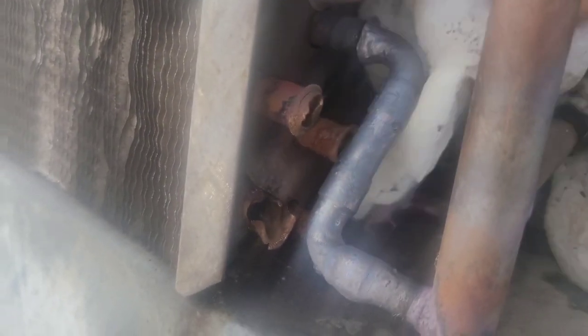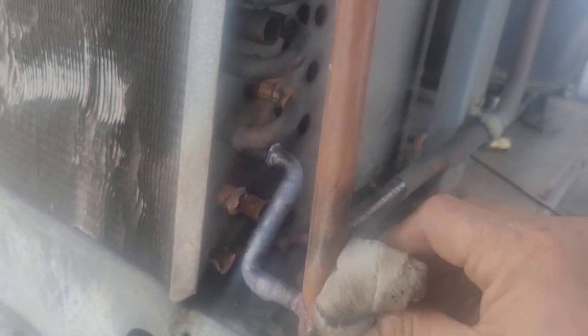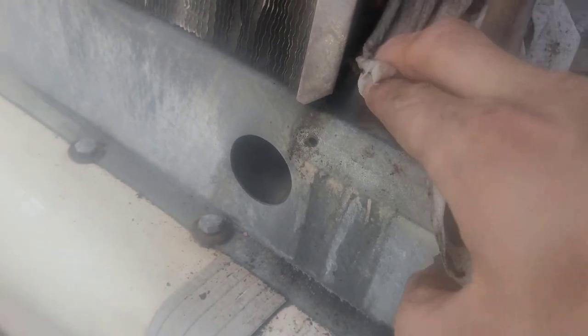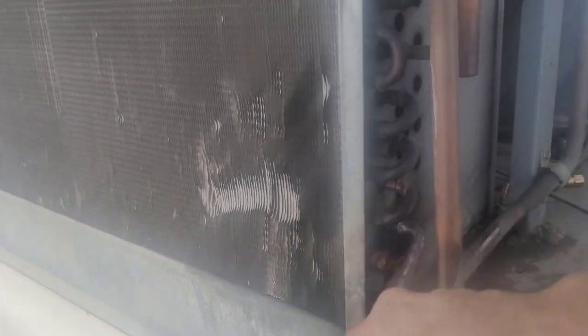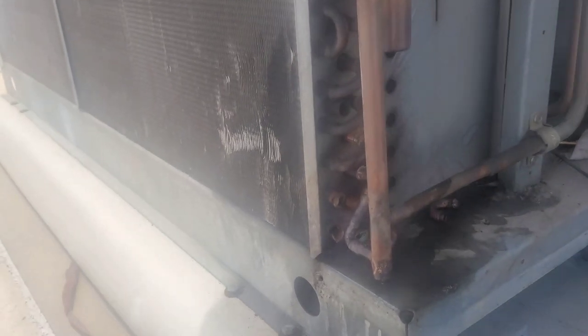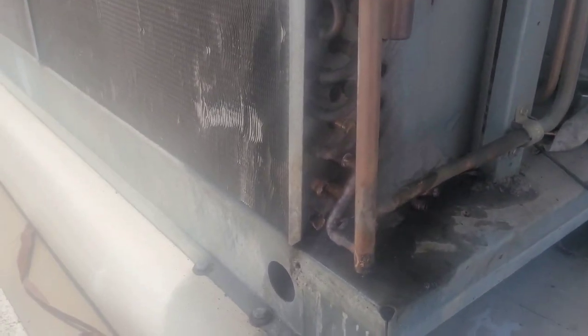It's soldered - part of the circuit now. The leak has been eliminated. Now we can go about pressurizing it after we cool it down. Pressurize it and test it to see if what you did makes a difference. In this case we're going to be replacing this condenser coil because the store is going to get a new coil, but in the meantime EPA rules say we're not allowed to leave a leak unresolved.